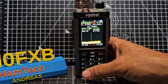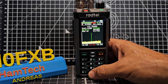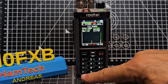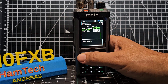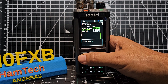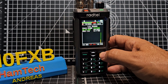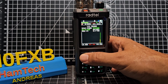For squelch, press the star button — you've moved down to squelch. Setting it to all zeros... I just accidentally changed the mode. The flat line button is changing the mode: FM, AM, and SSB. Note that SSB uses the first antenna and is VHF/UHF.